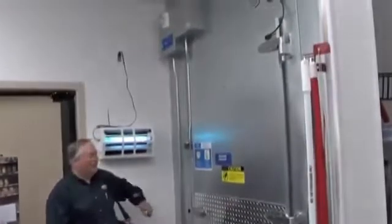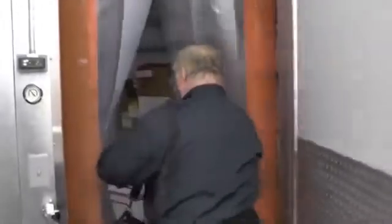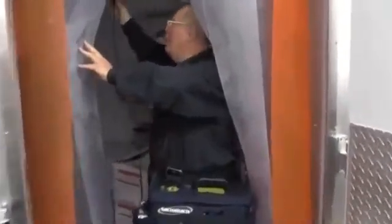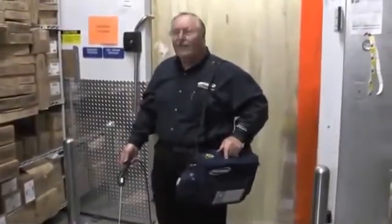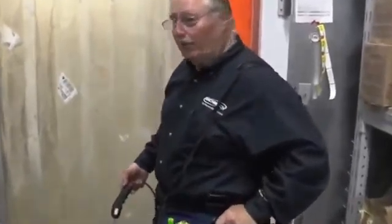Testing in the walk-in freezer is pretty simple. We're going to walk in and check both low and high for any leaks. Once I enter the freezer, I'll let the probe down near the floor and also reach up into the air circulation. In higher places, you may want a ladder to get closer. Either one is going to tell me very quickly if I have gas in this room. We walked in and immediately got a hit — we have a leak somewhere in there. Keep in mind this only responds to refrigerant, so it didn't go off as a false alarm from the cold. It's picked up actual refrigerant in this freezer.